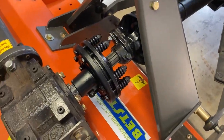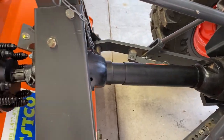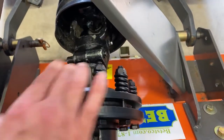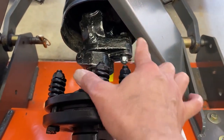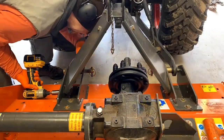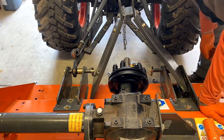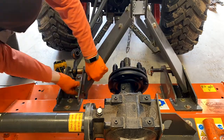The slip clutch is already installed here. I had to cut the shaft, so I spared you on that — you already know how to do that. And then there's the shear bolt, and it comes close to the housing or the frame but it doesn't hit or touch. It was so close I decided to try to move the top bracket over so it wouldn't be so close to the frame, but then it was just close on the other side. I think it has something to do with the offset of the flail mower.